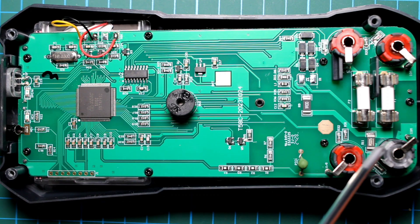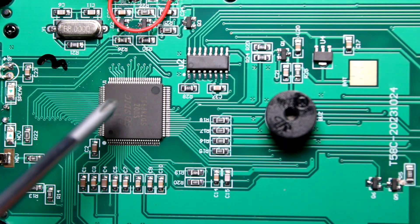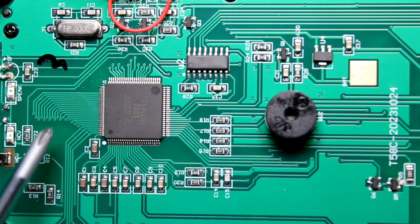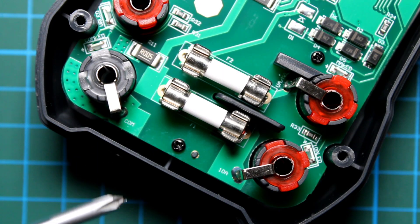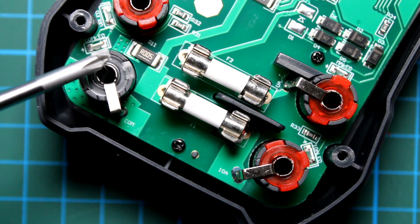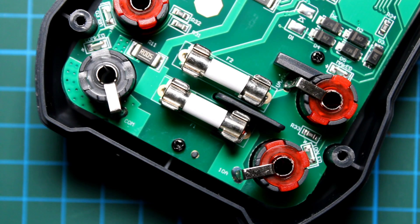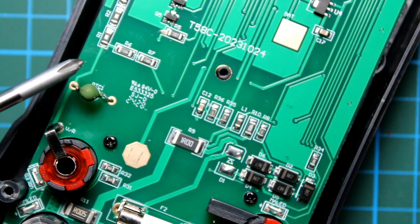Take a good hard look — we don't have a current shunt per se; we have a current sensing resistor but not a current shunt. Here we are just a little bit closer: there's that main multimeter IC — a pretty new one, hard to get any data sheet on this chip. Right beside it is the 8107, that 20-bit analog-to-digital converter. Those 5x20 fuses are small — it's a good thing you get extras with the meter. Split variety jacks, and that tiny current shunt resistor. Nice spark gap protection, and one lonely PTC for input protection.